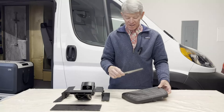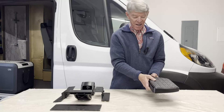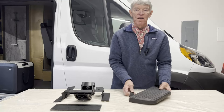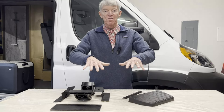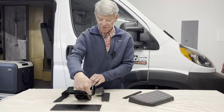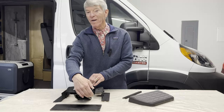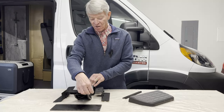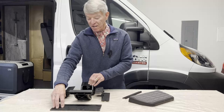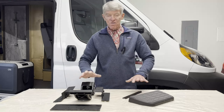I built a little accessory to put underneath the step to give it a nice square support for bolting it down, making sure it bolts flat and has enough strength so it doesn't move around. I also had to shave off a little material from the bottom of the aluminum casting because it wasn't quite flat — I wanted good solid straight surfaces on both edges to mount my bracket to. That's pretty much how this thing all fits together.